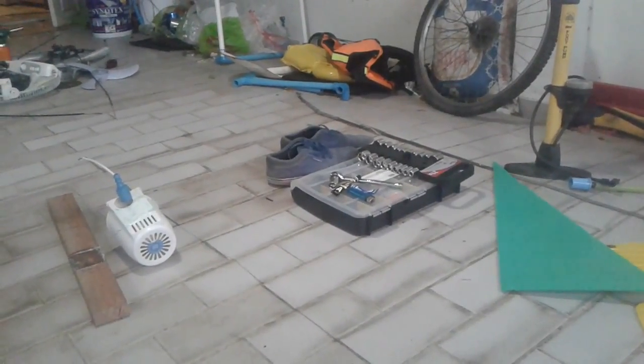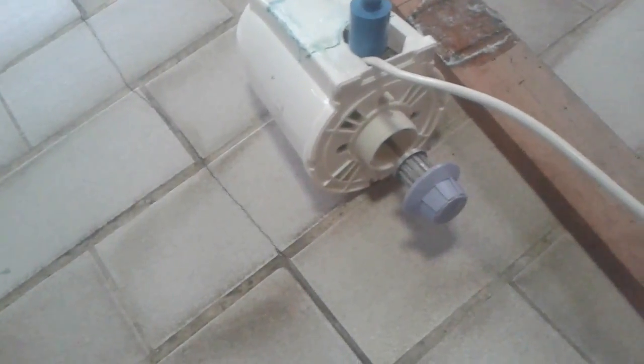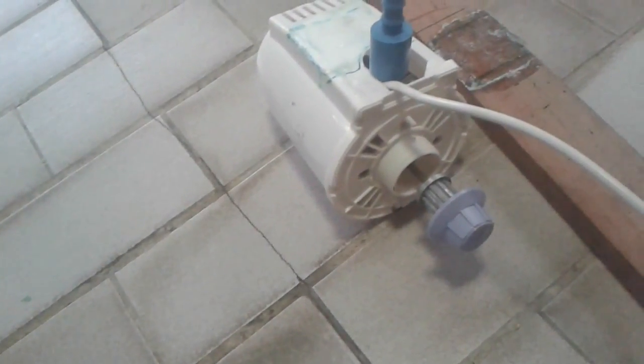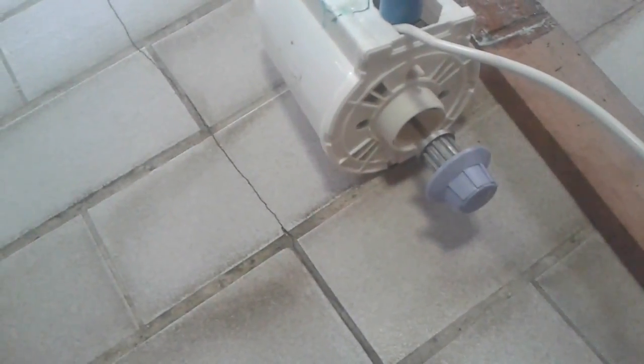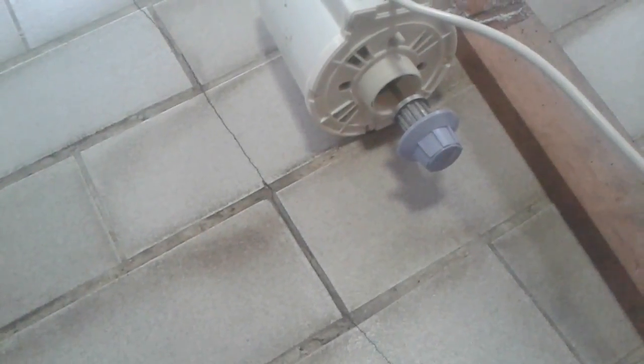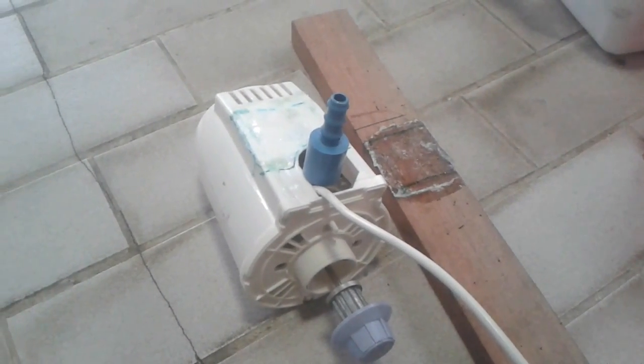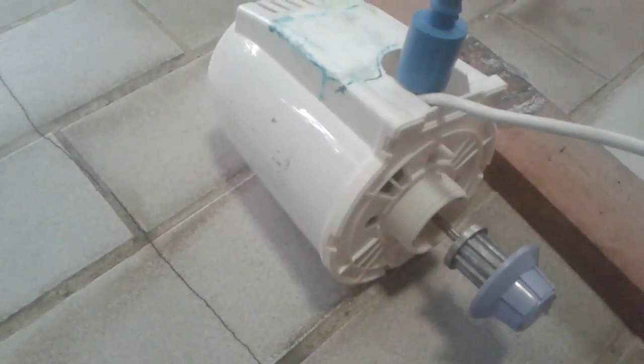The motor I'm using for these trial experiments is a 12-volt fan motor. We tested it yesterday with my kid pedaling - I held the motor and he was able to get up to 17-18 watts, almost 1.5 to 2 amps just from him pedaling. That means we could generate up to 20-30 watts with just this little DC fan motor. Right now I've got this wood here with some marine grade epoxy trying to mount the motor onto a piece of wood so I can mount it onto the back to keep it stationary, since there are no mounting brackets on this fan motor.